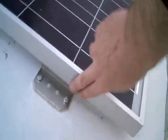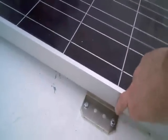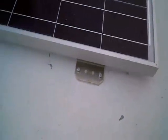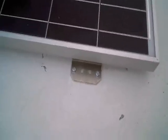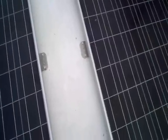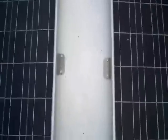Here's a shot of the roof in the dying light. The feet mount with a Z-shaped bracket, U-channel, and quarter-by-20 bolts. It came with one hole and one bolt, nut and washer per bracket, but I actually put in two — an additional stainless steel bolt, nut, and a couple washers — and I've Loctited them. I went with six mounting feet per panel; I'm sure they're plenty well attached, but I thought that would take some of the stress off the panel frame.